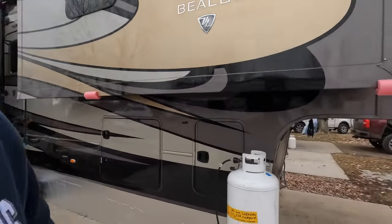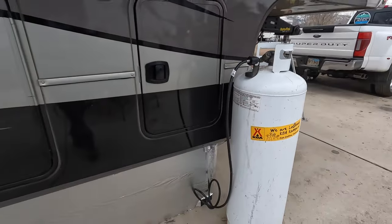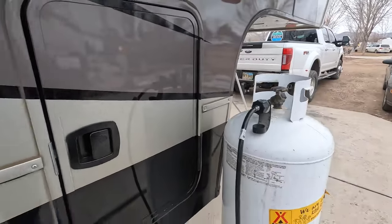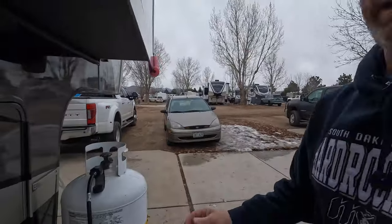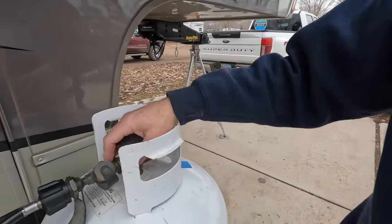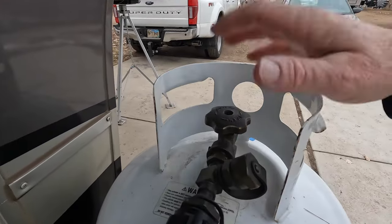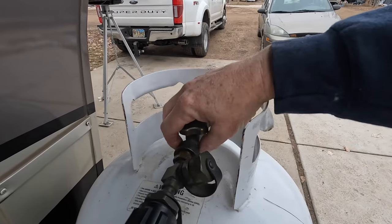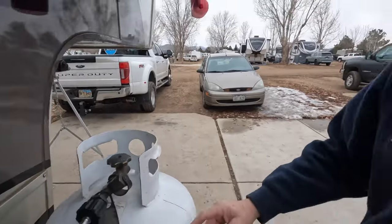Let's get down to the nitty gritty. The 100-pound tank is on the outside and we have a 12-foot line connected to an adapter. I want to make sure you know this: the old-style valves are still on these 100-pounders, so you need to buy an adapter that threads inward and puts the new quick connect on the outside of it. I believe that adapter cost about 30 bucks. I'll find one on Amazon and put it down in the description, as well as this hose — that's where we got the hose from.